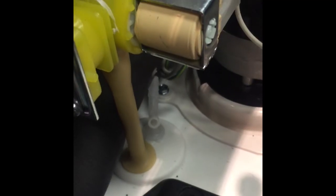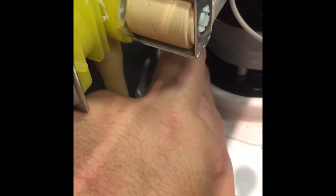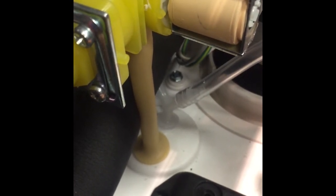Right inside the unit you can see a little Y connector next to my water valve inlet. I've poked the membrane out of the connector that goes through the chassis of the machine into the water trough, and I've blocked up one side of that Y connector on the AUX cleaner system because I don't need both sides. Then I'm going to connect the tube to it to feed the chemical in. I make sure this clear tube is not rubbing up against any hot refrigerant lines, and double-check the wires to make sure they're not snagged or rubbing against any refrigeration tubing.